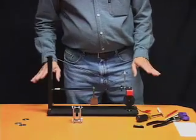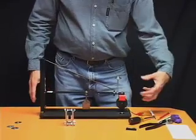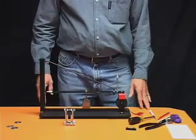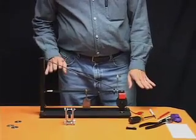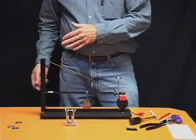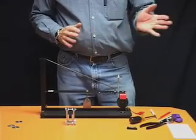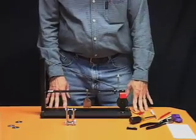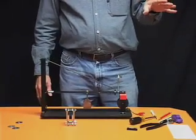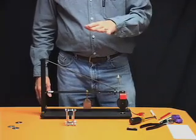One thing to keep in mind when you set up the instrument in its final location: don't put it where you can't get your head in there, or at least a mirror, in order to look and make sure you're not scraping. One thing that can happen is you think the instrument is set up right and it has been working in the past, but all of a sudden it doesn't record earthquakes. You think it's still working because if you lean on the table or make some really large motion, you see some response of the trace — so it is responding, it just doesn't pick up earthquakes.